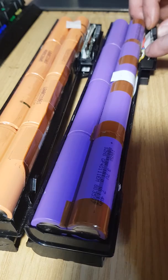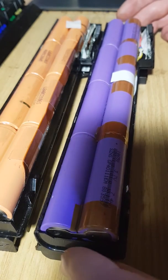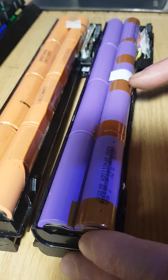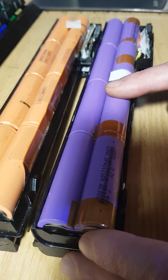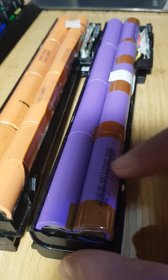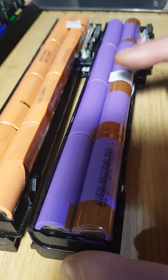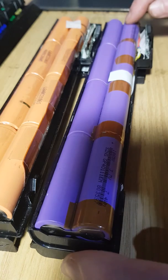So that's its maximum circuit charge, obviously with these cells full, because 3.7 volts is the nominal voltage. When these cells get fully charged, they could be up to the actual charged voltage, which is 4.2 volts. The 3.7 is the nominal, the sort of average of the lowest and the highest. And with these being a 4.2 constant voltage, that's where you're going to be.